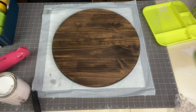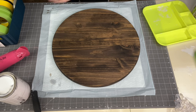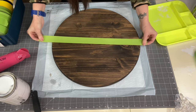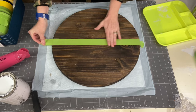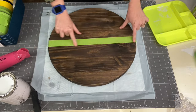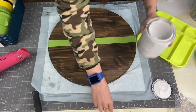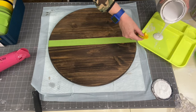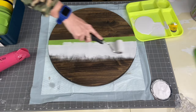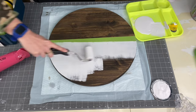So now we are trying to find a line on our wood round. These are pine wood pieces that are glued together, so there are lines there for you — utilize them. Now I'm taking 233 Plus automotive tape by Scotch. It is more expensive than regular painter's tape, but I have never had a bleed with this tape. All my supplies are linked in my Amazon store in the description box. Now I'm taking linen white by Rust-Oleum — this is a chalk paint — using a sponge roller with a very light hand. You should never have to apply pressure to the sponge roller at all.